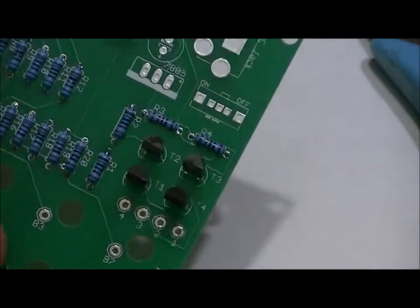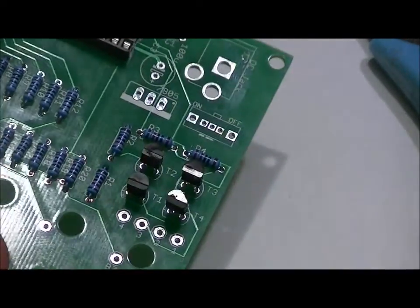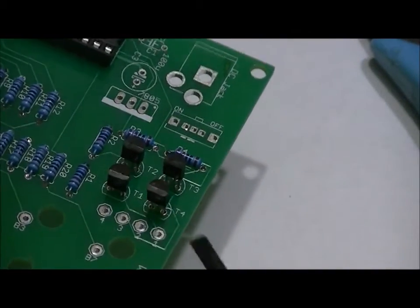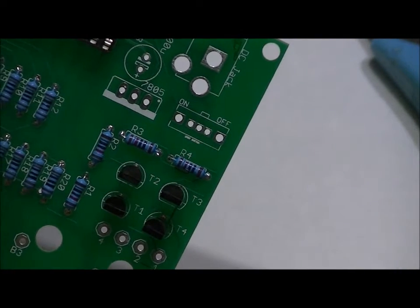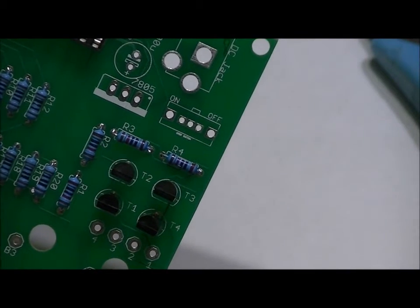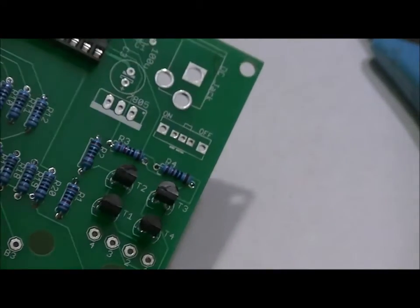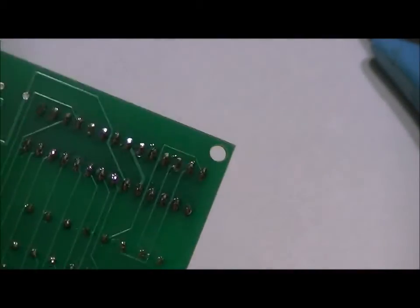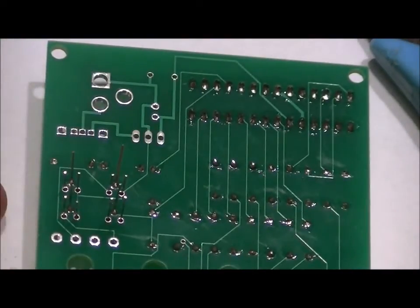These are 4 nicely placed transistors. And as you can see from this angle, the backs, the flat sides, are facing the flat bit on the footprint. Again, probably pretty difficult to see, but from a bird's eye view, the curved side is facing the curved side of the footprint, and the flat side is facing the flat side of the footprint. These are four properly placed transistors. Socket is soldered. Everything's hunky-dory. Finish soldering your transistors. And next we'll go on again to the capacitors and the switch.